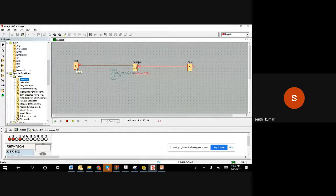From that time onwards, if anyone comes inside, it will make a noise, right? So this is a small circuit. This is the small logic requirement that is already in all safety systems. That's how it is designed actually, right? Hope the on delay timer function is clear now. Just to recap, with the on delay timer, when you switch something on, it won't become on immediately. It makes a certain delay, which you can always define, and after the time, the output becomes on. So this is the concept. I hope this is clear.